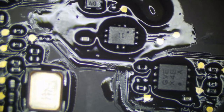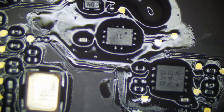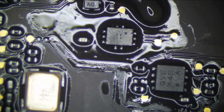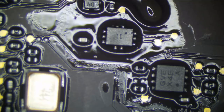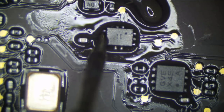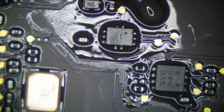And that's really bizarre because I'm really surprised the CPU would even let the board turn on if PM Sleep S4L was partially shorted. Because that is a real finicky rail, and almost always, if you have a short, that's going to be pulled down to nothing instantly. Because the CPU is not made to send out current like that. And there's no short there. Okay, let's do this again.